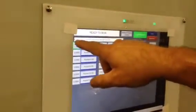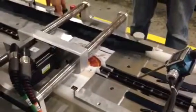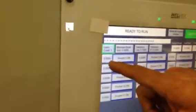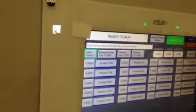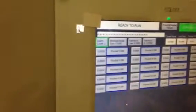At this point, the signature 1 or book 1 is 1 pin space away from the caliper. But you can see here it is. When it gets to this point, it's ready to check the book, in which it's right there at register 0. And what the caliper is going to do, when it checks that book, it's going to look to see what size it's supposed to be in pocket 1. Since it's a 0, the caliper knows it's empty, so it says this is a new book, takes a reading of the book and adds a 1 to it.